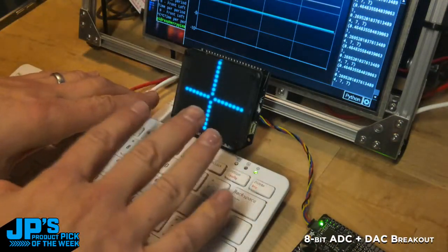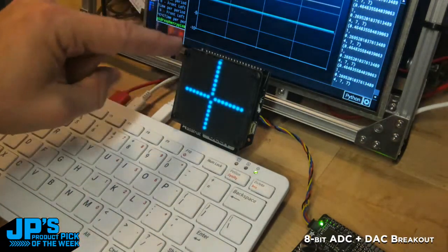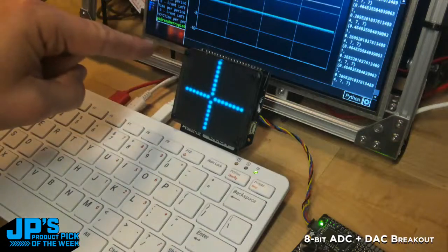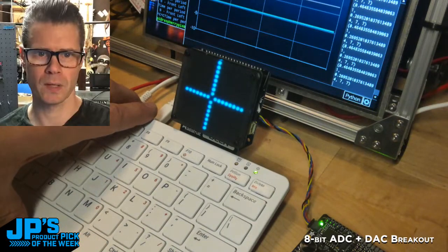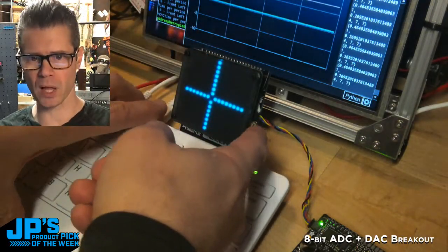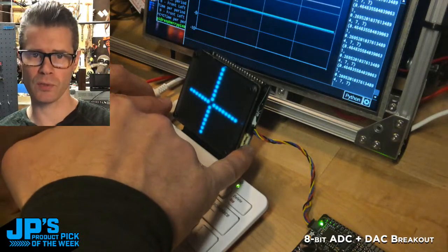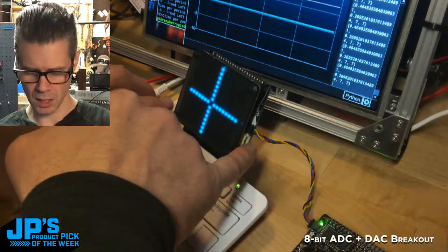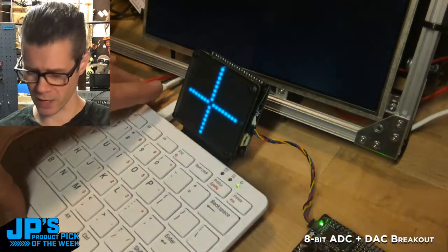That gives us the ability to plug in any of the normal Pi hats or bonnets at a jaunty 30-degree angle. It can really only be described as jaunty, I promise you. I've tried other things and it doesn't work, you can't say it. This also gives us a couple of STEMMA QT breakouts and STEMMA breakouts, which are the 3-pin larger JST PH, so that we can plug in things like NeoPixel strips or other 3-wire devices.